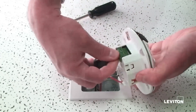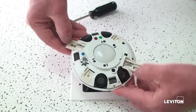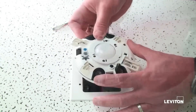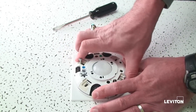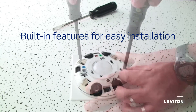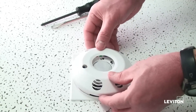Now insert the low voltage connector. Pull the coasters out. Choose the orientation and application you want the sensor to be based on. Push the unit so the screws come through the coaster, then push the coasters inside the unit. Tighten the screws so the sensor is fixed firmly. Snap the cover on and your sensor is installed.